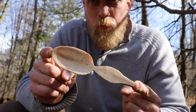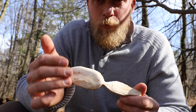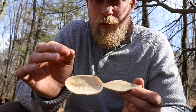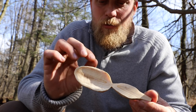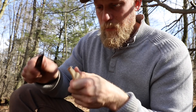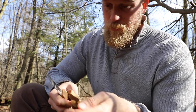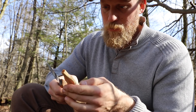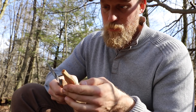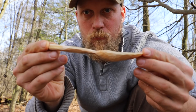Roughing out our spoon is now complete. This might be a little further than most people would consider roughing something out, because this is actually usable at this point. But I really wanna touch this up — it's that fine detail work that really separates a good carving from a not-so-good one. This is the tedious work — take your time, adjust those angles, thin things out, make your slopes more even. Every angle you should try to have as much symmetry around the piece as you can. Even those little humps or bumps — chip them away.